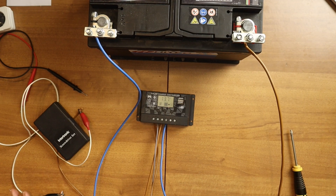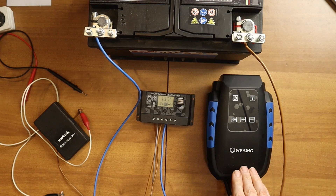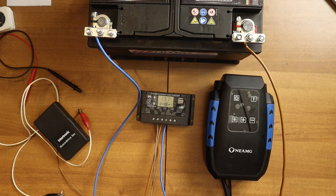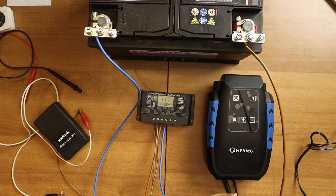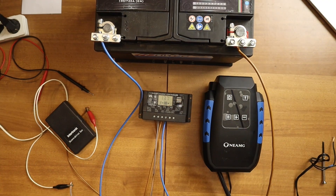What we can do now is put it on this compressor. With this compressor you can put compressed air in a tire, and this takes 10 ampere — quite some current flowing to the MOSFETs. But it's rated for 20 ampere, this solar controller, so you can do that. So what we will do now is put here the connections for the users, and I put here a quick connection. We take care of the polarity — that's important — the brown for the plus and the blue one for the minus.